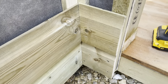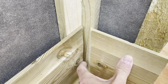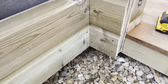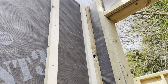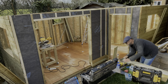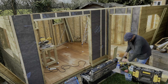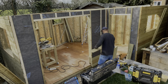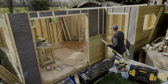What we're doing here - as we put this cladding on, we're mitering it. So that's inverted, and we're just mitering it all the way in. I'm also gluing it so it won't come apart. That's how we're doing that corner - mitering all the way up.